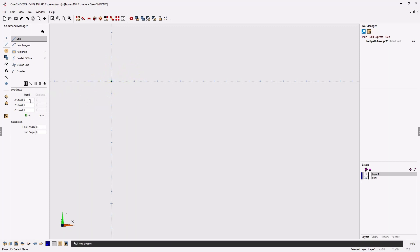I'm going to move my cursor back to coordinate input and we want this line to terminate at 150 millimeters. I'll type in 150 and click OK. I call this the direct approach for coordinate input. Now I want the next line to terminate at Y minus 50 — that looks good so I'll click OK. Now I want this line to terminate at X120 — that looks great so I'll click OK. Notice how I'm only typing in values for the axis that changes.